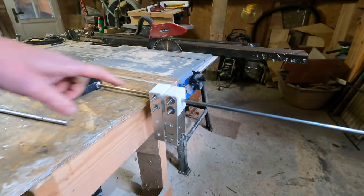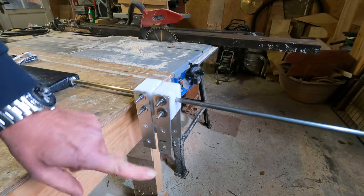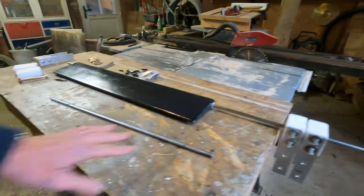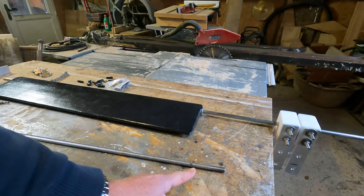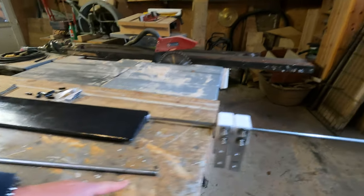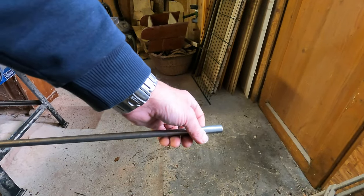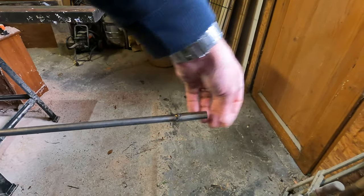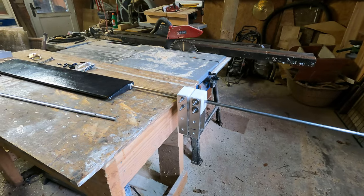So we're back in the workshop now with the trim tab. And I need to make sure all of this stainless is insulated from the aluminium. I've got this extension piece that needs a bit of work done on it. It's a little bit too long. It needs a T on the top. I also want to keep it removable here. So I'm going to make a clever mechanical fitting here that allows me to lock it in position, but remove it. And then I've got a couple more bearing blocks to make.